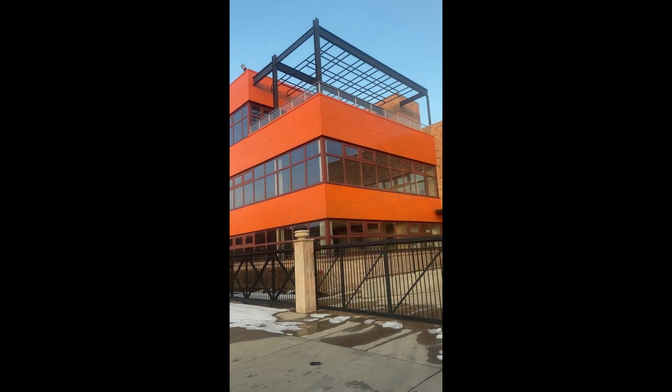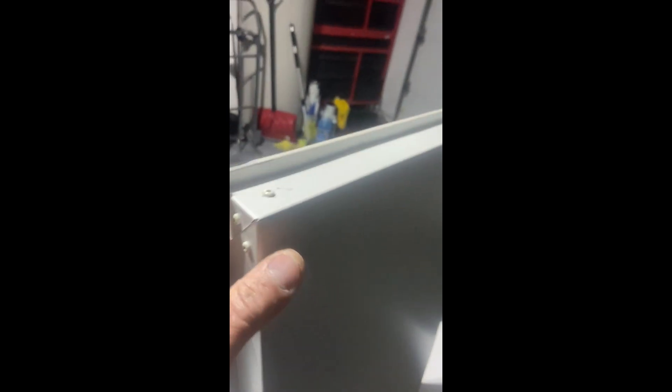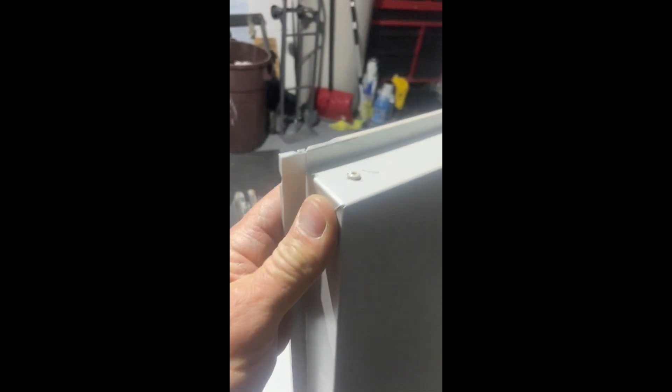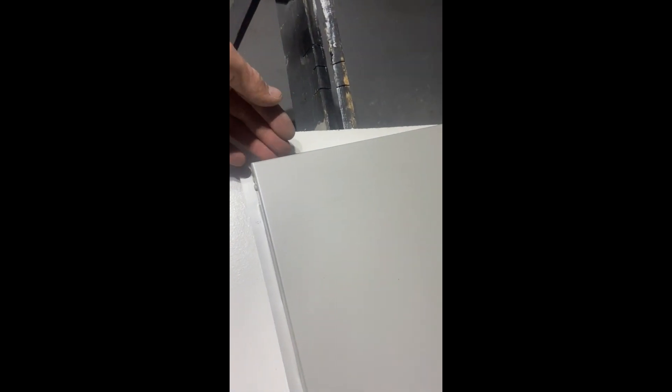This building that you see — we did the facade on it with aluminum composite panels, panels like this. Let me show you how I make them. The simplest ACM aluminum panel looks like this: half-inch band at the beginning, then inch and a half here. Instead of screws you usually have to use rivets — just for this video I use screws to make it quicker — and 45 degrees on top. I cut on the side and on the bottom, and the purpose of this is so the water from the top will go around the panel and will not get inside.